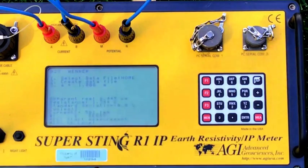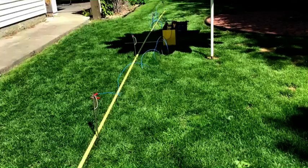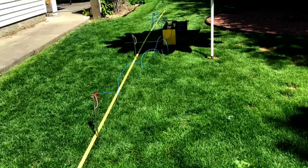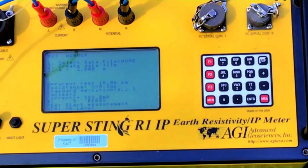Next station will be a 2-meter probe separation. The stakes have been moved to a 2-meter interval spacing. There was some troubleshooting: I had a banana plug come loose — that was hard to detect — and then one of my current electrodes lost connection to its clamp, giving a high voltage reading. First reading at 2 meters: apparent resistivity 10.06 ohm-meters, resistance 800.8 milliohms, standard deviation 0.2, current 589.8 milliamps.